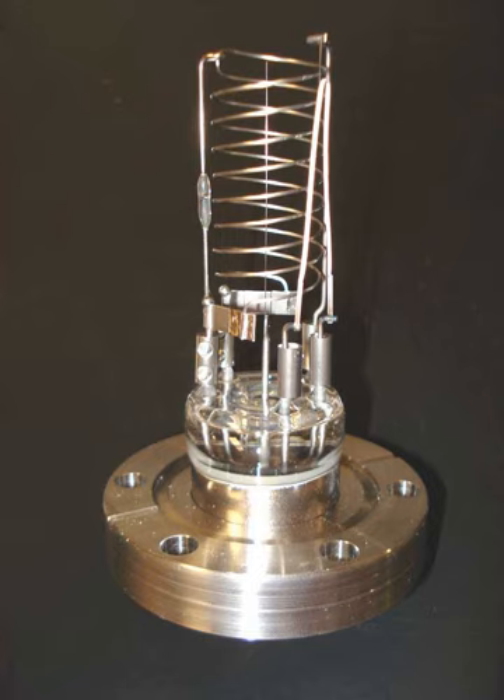The filament voltage to ground is usually at a potential of 30 volts, while the grid voltage is at 180 to 210 volts DC, unless there is an optional electron bombardment feature by heating the grid, which may have a high potential of approximately 565 volts. The most common ion gauge is the hot cathode Bayard-Alpert gauge, with a small collector inside the grid. A glass envelope with an opening to the vacuum can surround the electrodes, but usually the nude gauge is inserted in the vacuum chamber directly, the pins being fed through a ceramic plate in the wall of the chamber.